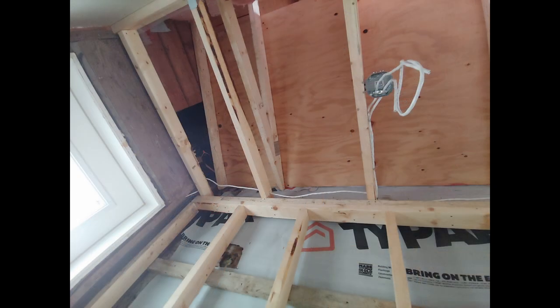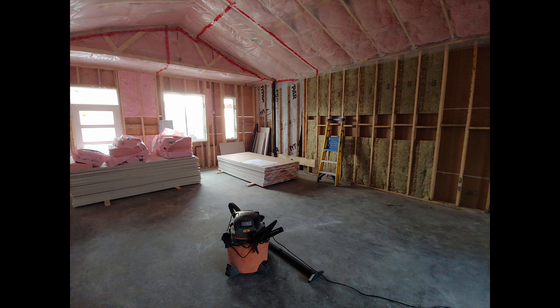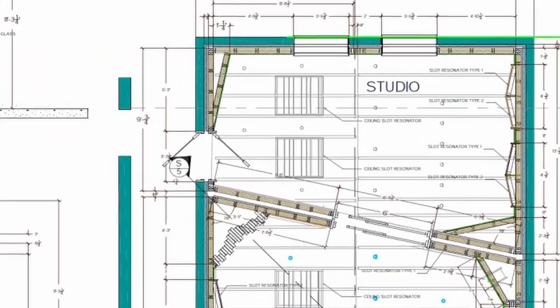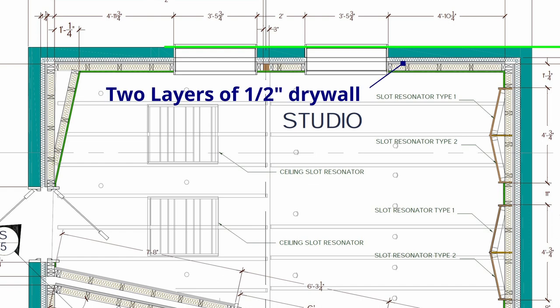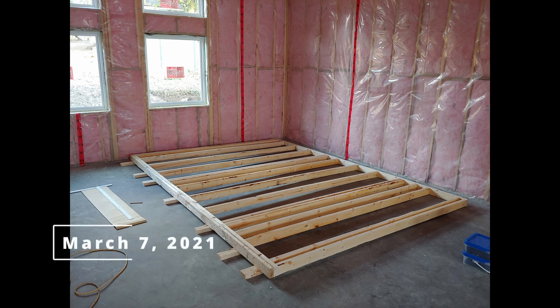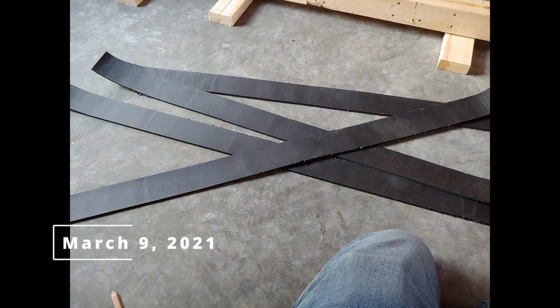I got the lights lined up for the hallway and had also started the interior Roxul insulation. Now, the plans themselves were your typical room-within-a-room construction for soundproofing. But interestingly, this design required the drywall to be placed on the outside of the inner wall — between the two walls. So what this meant was I had to build the walls lying down, put the drywall on them, and then stand them up.